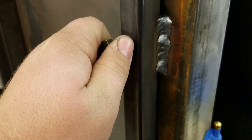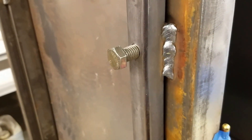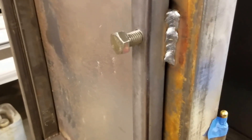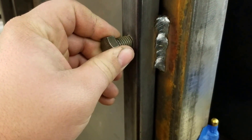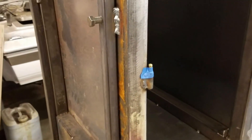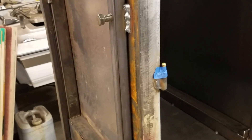We can loosen this up, but they're just in there free rather than trying to drill and tap. When we weld it, the heat warps it and all that stuff, so we just made it so the half-inch nut slides down in there. We've got these guys in there in case they decide to move, but they fit in there pretty snug — the nuts are just friction fit.